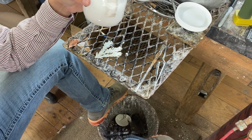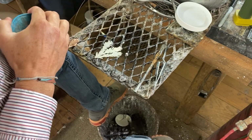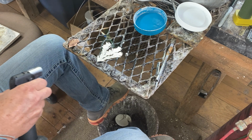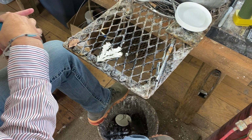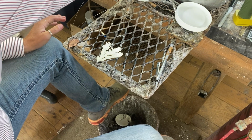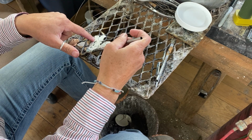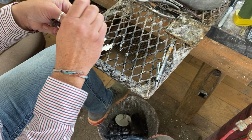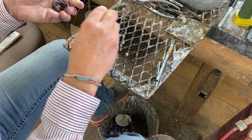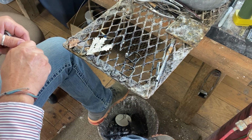Okay, so this beautiful container is full of boric acid and denatured alcohol. What I will do is paint my slurry, and then you light it on fire, and you can see a green flame. It forms a crust on the back of it, and that is supposed to hold back the heat scale while doing this. Then I paint my flux on the top. I also use these tungsten strips that I've bent into different shapes, so I can make them however I want to hold my pieces down, so they're not sliding all over the place, and you can keep something right where you want it.